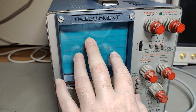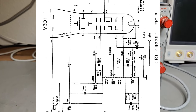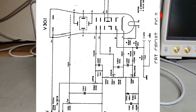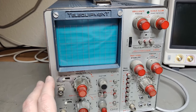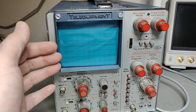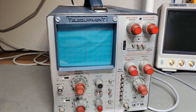The CRT is a conventional single-deflection CRT, which means it uses alternating chop and all that kind of stuff. There is one deflection amplifier — not like the older previous models with different beams and different deflection systems. So this is a quite conventional oscilloscope.